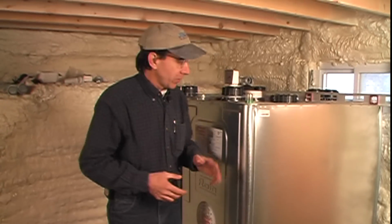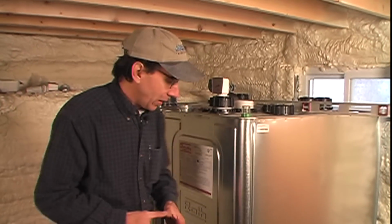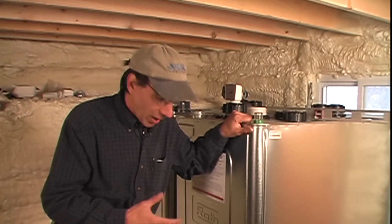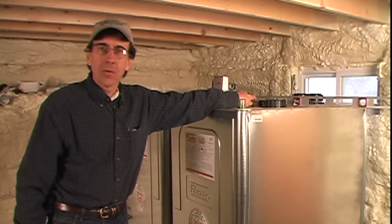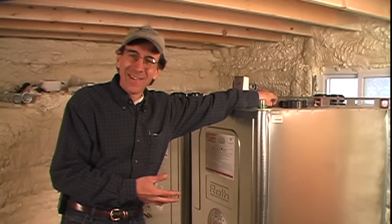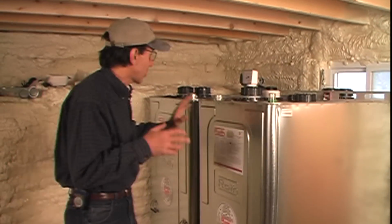They're plastic tanks. The other thing with plastic tanks is you get condensation in oil tanks. A standard steel oil tank tends to have condensation, and that water that condenses through the vent pipes that go outside tends to mix with the oil and, with the steel lining on a steel tank, makes it rust. And believe it or not, we also start to have bacteria living off that. That bacteria makes sludge. Sludge settles in the bottom of the tank, your oil burner picks it up, and you have to have more service than you might normally have to have. With a plastic tank, there's nothing in there to corrode, so we don't have corrosion. And the tanks give us much cleaner oil than we would otherwise get with a steel tank. So, another positive.